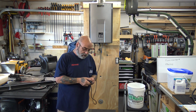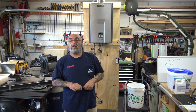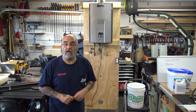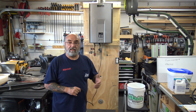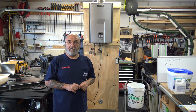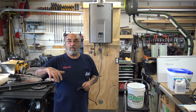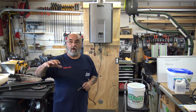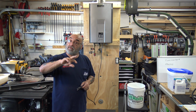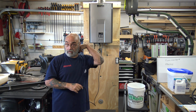Now here's a big question that I get from a lot of contractors and plumbers. They call me and say, hey, I just did a brand new house, I set all the fixtures, I put the tankless on, and I turned the water on, and I get no water from the hot side. That's because the water servo valve is closed. Here in Florida, when we had hurricanes and they lost power, the water servo valve became closed. You can't use your shower because it's pressure balanced, so you need pressure on the hot side in order for the shower body to flow water.